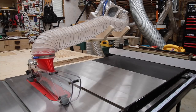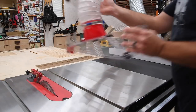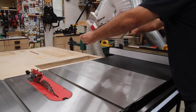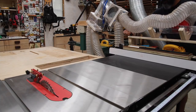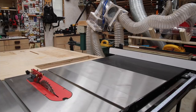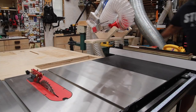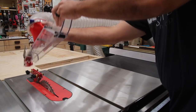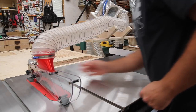You can see I'm putting it right at about 36 inches and it works fine. I want to demonstrate getting everything out of the way — the shark guard is really nice because just one or two little movements and it's up out of the way. Then I can loosen that knob and swing the arm out of the way over the fence, still not hitting anything. It's out of the way, real nice and neat. When I get ready to put it back, it's just a couple little movements: loosen the knob, swing the arm back, tighten it down, and put the guard back on.